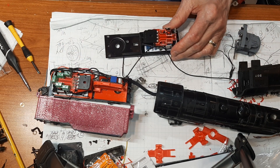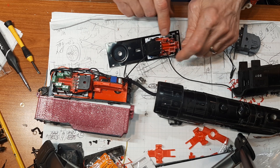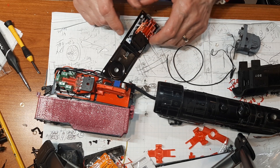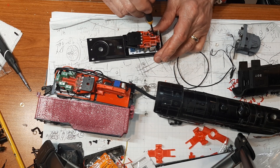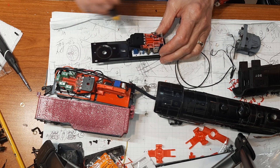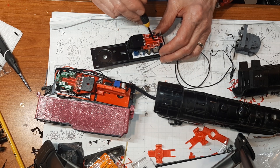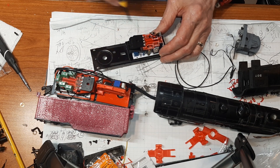If you want, take your voltmeter, put this on the track, turn on your transformer, and touch the center leads with the voltmeter — those are AC. Then switch your voltmeter to DC and touch the outside leads and look for DC current depending on your transformer. Touch the positive outputs — positives are here, here, and here on these outputs — right and left positive lead here, negative lead here, and make sure each one is hot. The smoke gets its power from the top rectifier; the WEMOS digital board and motor control board get their power from the lower one.